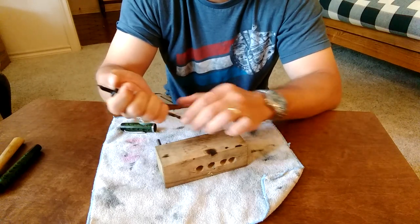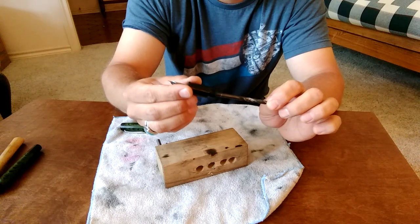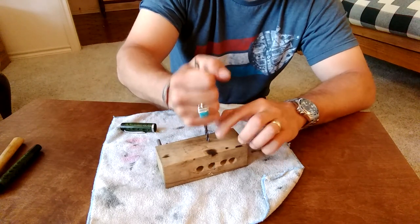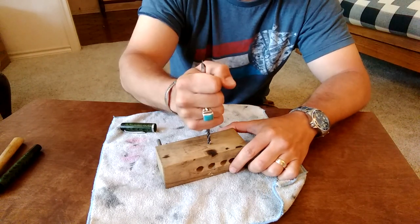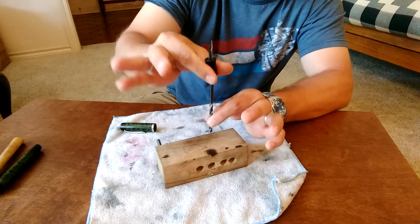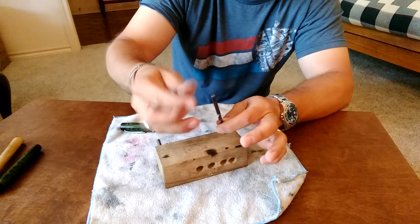The process is pretty simple — you just insert that drill bit into the back of the section where it meets the feed. I'm going to do it on a piece of wood so I don't damage my table, and I'm just going to pound this down, essentially making a reverse knockout block. I'm holding the drill bit on the flat back side so it doesn't damage my feed.